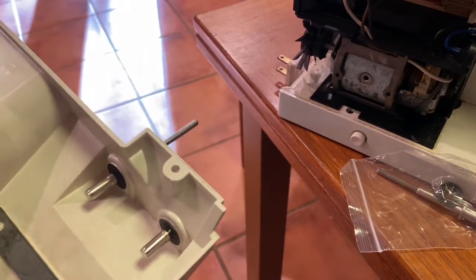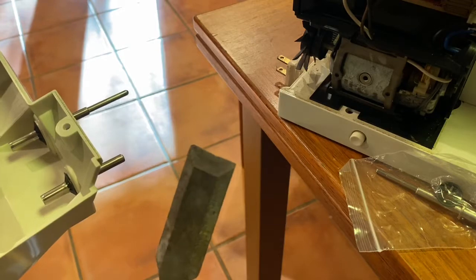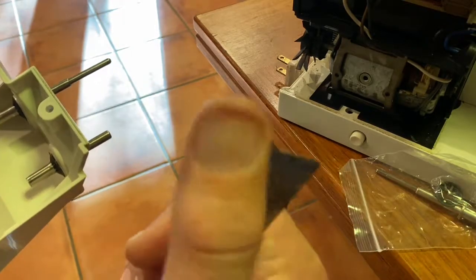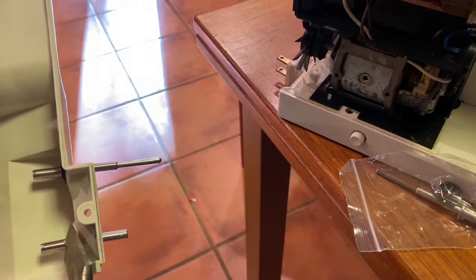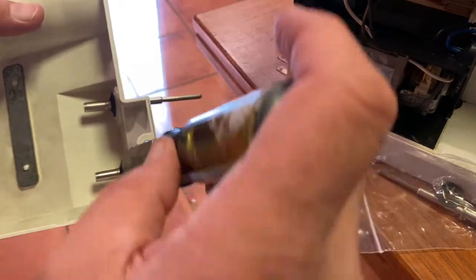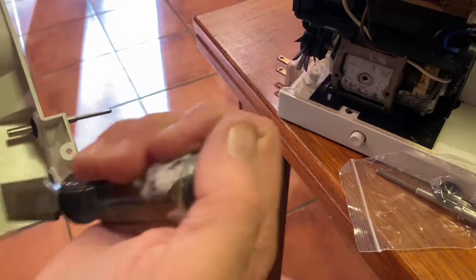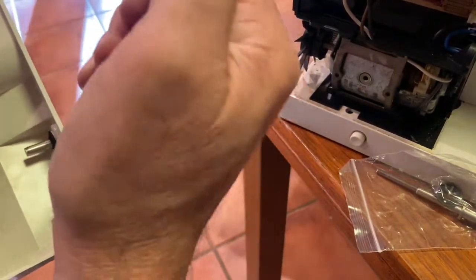This is the sequence of events I used. I took an old gasket scraper chisel like this — it's necessarily sharper on the end. You want something pretty sharp to get underneath and get started. Very gently put the sharp edge in here and then work it back and forth very gently. Get it loosened up a little bit, then you can turn the entire spool and do it again.